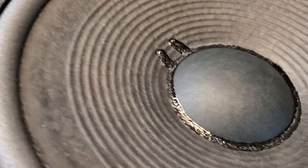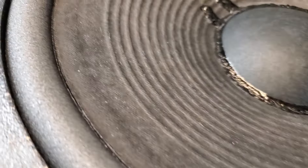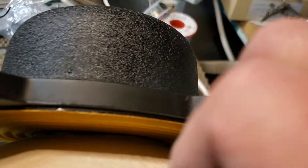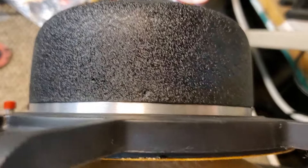Customers send me things to be repaired. This particular example came out of a JBL 166. It was fully original — 1977 was the build date according to the voice coil. This was a pretty much straightforward resuspension: clean the old surround off, remove the old spider. The lead wires were oxidized on this so I put new lead wires on it.